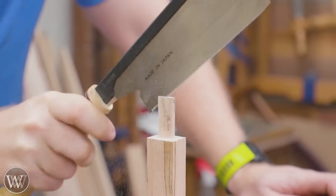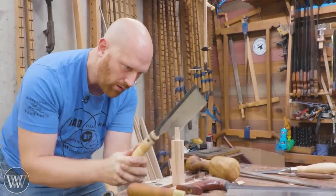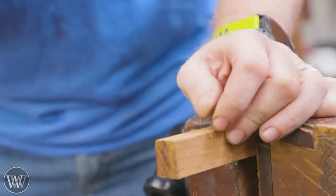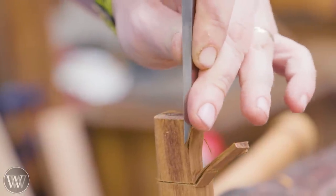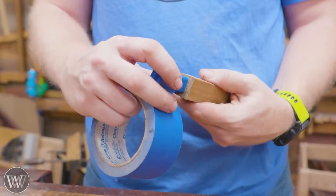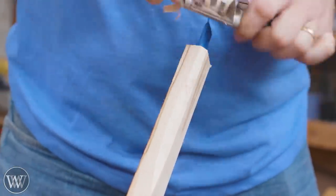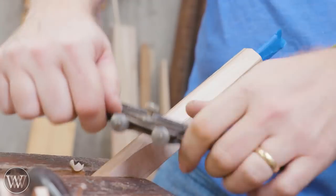For this one, we're going to be putting a wedge in the top, and it's much easier to split it. I'm actually going to be using a small Japanese saw because it's got a very thin plate. Some people will drill a hole at the bottom to stop the split, but that doesn't work very well in small pieces like this. We're making three tenons and then we'll tape them off because we're going to be shaping everything else down - I don't want to hit that. Those are precisely the size they want, so I use four or five layers of tape so that if I accidentally hit some tape, it won't go all the way down to the tenon.